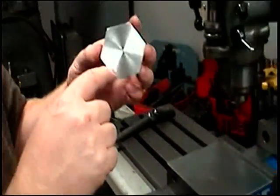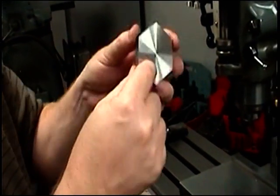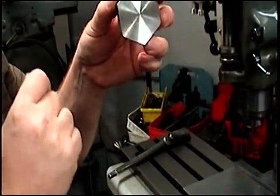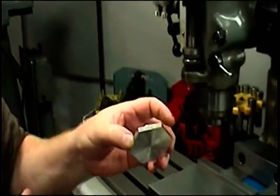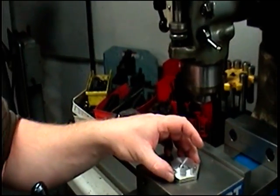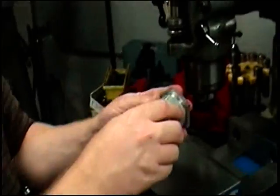No, a regular cut. A file will mess up the rest of the finish — do it again with the lathe. You were a little high with your tool; I can tell by the shape of it. It's up to you. Or you can always lap it with a piece of sandpaper on a piece of glass and some nice sandpaper. I'll do that.